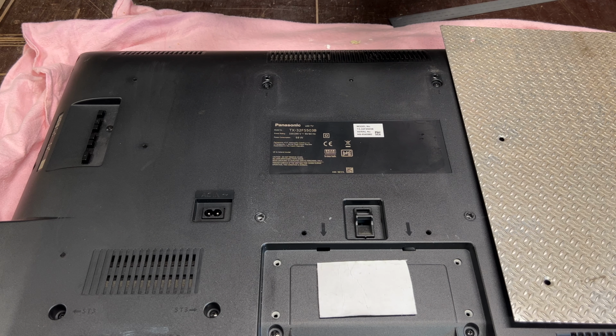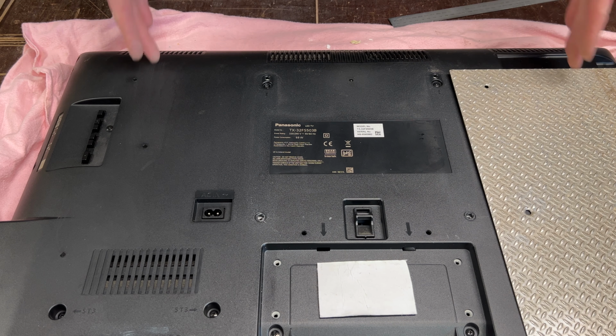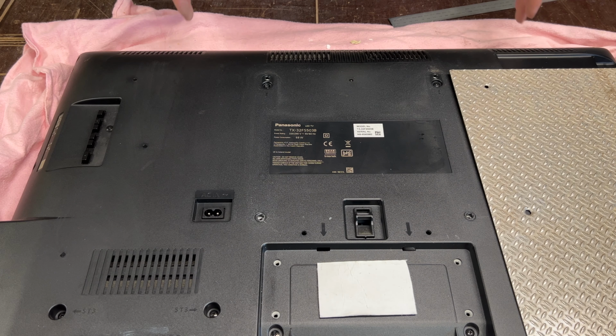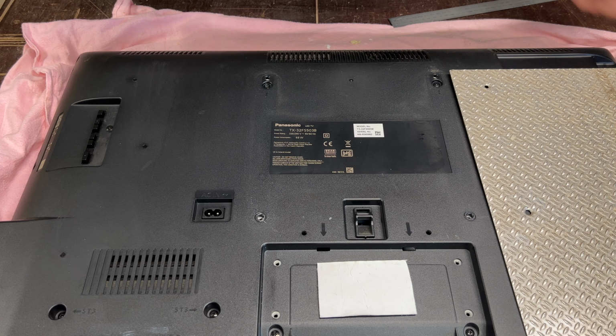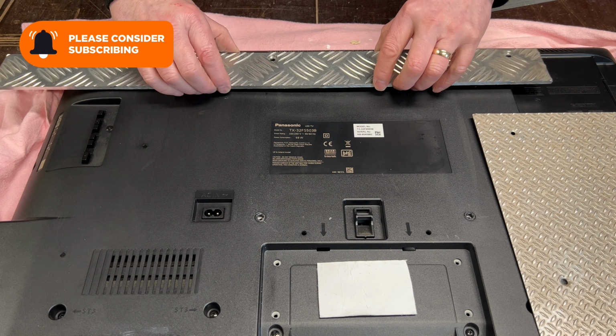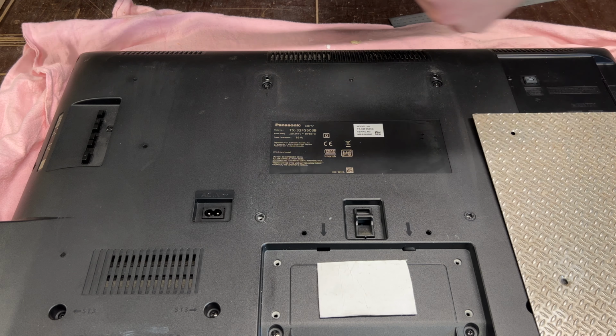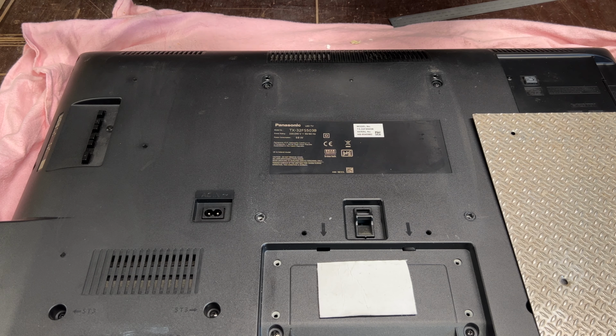This is going to be mounted on a stud wall in the kitchen. So you imagine the stud wall has got wooden beams behind the plasterboard running here. What I'm going to do is have another scrap bit of aluminium, cut it to the right length so it catches the beams, and just put a bolt sticking out of it. So this would be mounted on the wall with a bolt sticking out, and the TV would hang off it, just like a picture frame, really.